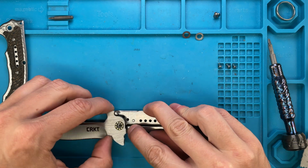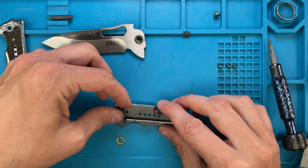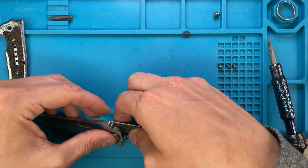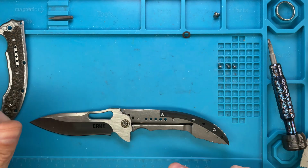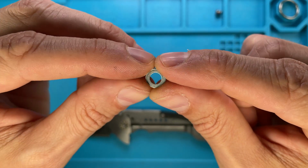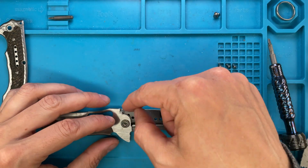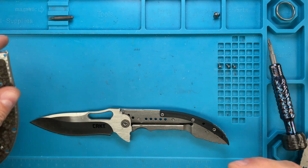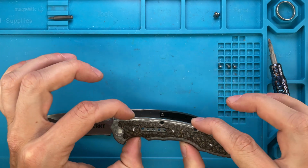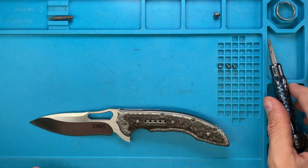Actually, you know what? I just missed one step over here, which is, don't forget to put the washer slash spacer. If it's there, probably there's some need for that. And then this guy can be probably sandwiched on, so make sure you find the groove. See, this side has the groove, this side doesn't have the groove, so just put it with the groove facing the bearing, of course, and then we can just pretty much go ahead, line up the pocket with that in a careful way so we don't move anything, like so. Just put it on top, and we're done, guys.